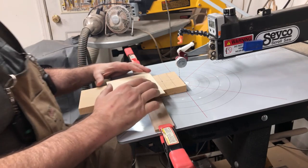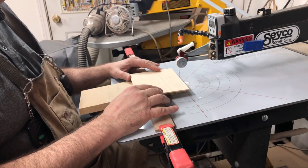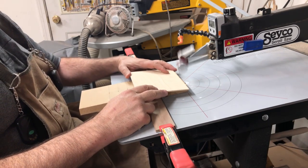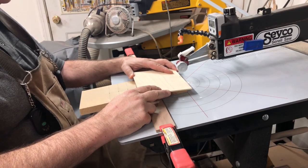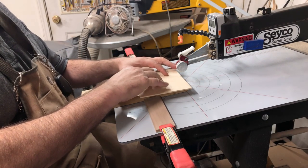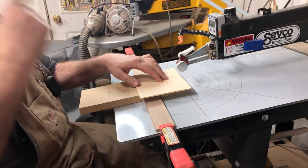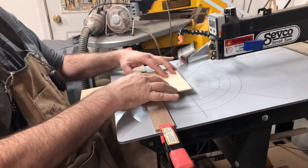When you get ready to start the cut, you can slide the board up to the edge, but it's actually easier to get a better cut if you cut a little bit into the board first. I'm going to raise the board so I'm not hitting the nail, cut a little groove — just about an eighth of an inch — then leave it sitting. Then take a mallet or just your fist and get that board seated on the tip of the nail. Now it's just as simple as starting the scroll saw and turning the blank.